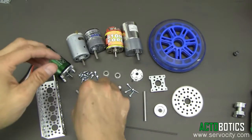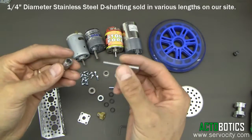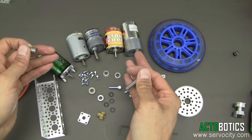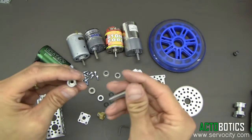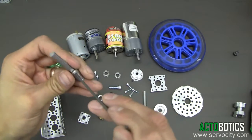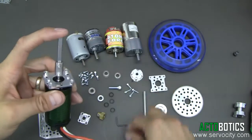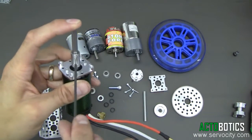Now that we've got that, we're going to go ahead and put together our shaft. You can utilize any length of shaft or d-shafting. We really like to use d-shafting with all of our channel — works really well. This is the eighth inch to quarter inch shaft coupler. Most of the RC car motors are going to have an eighth inch shaft, where a lot of the gear motors are actually going to have a six millimeter bore shaft. So this is an eighth inch to quarter inch shaft coupler. I'm going to go ahead and tighten that down and place it on the motor as well. You always want to put the largest end in first so it butts up against the smaller section. Tighten this down like so.